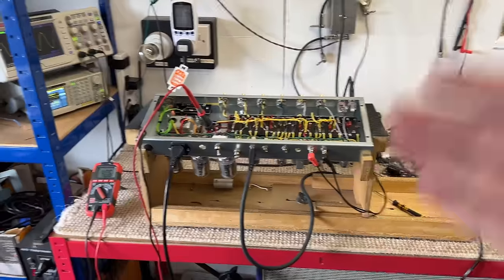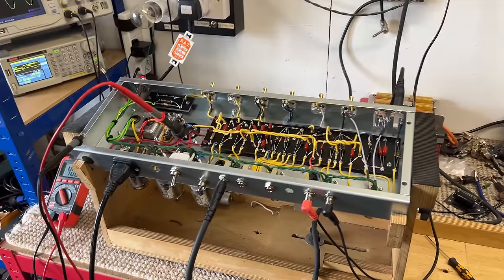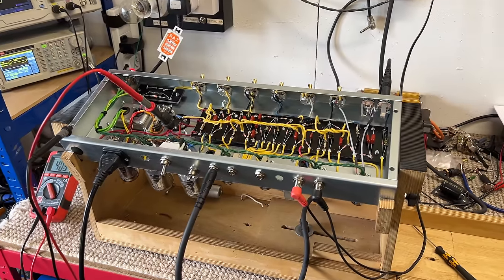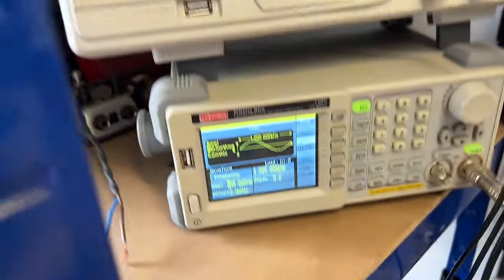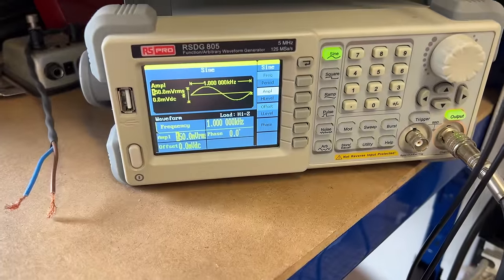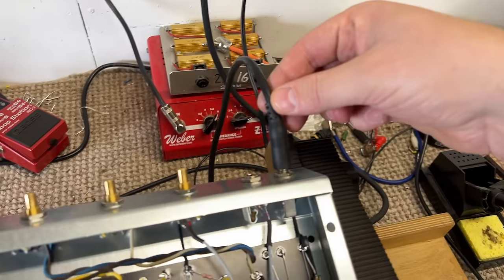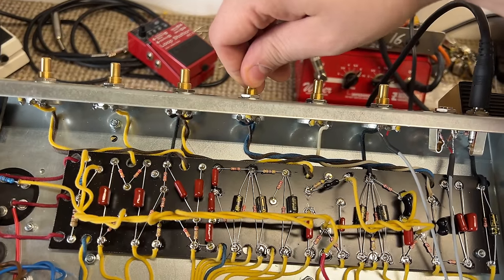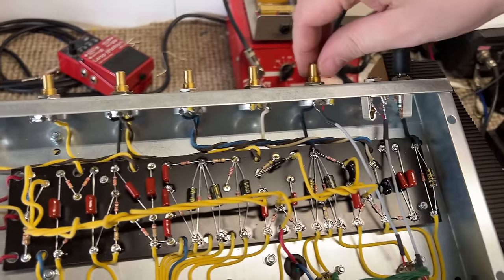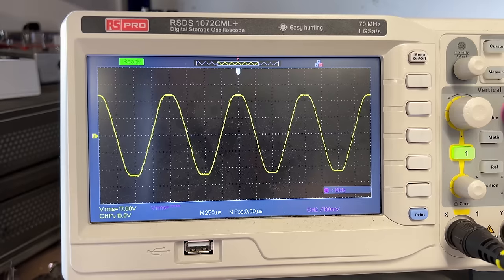Just finished wiring up the PR35 black panel for Coda Music, so I'm now burning it in on the test bench. A 150 millivolt RMS sine wave at 1 kilohertz is what I'm driving the front end of the amplifier with. Tone controls on zero — treble and bass — all effects are off, and we just bring the amplifier up to the point where it starts to square, then back it down slightly.